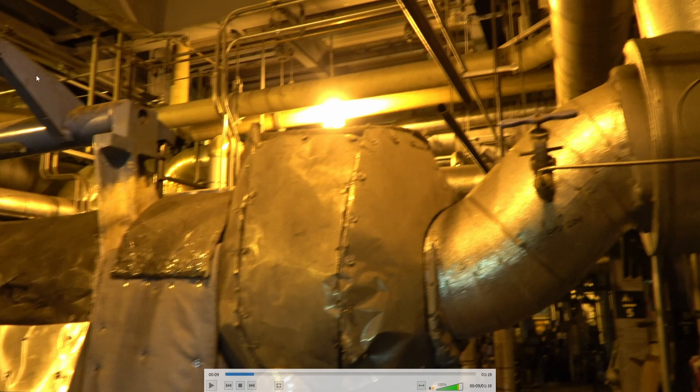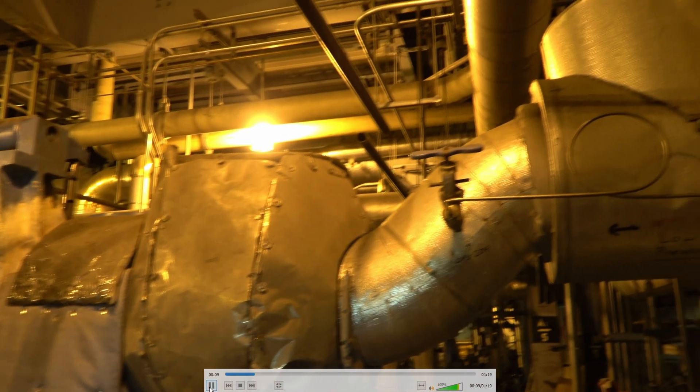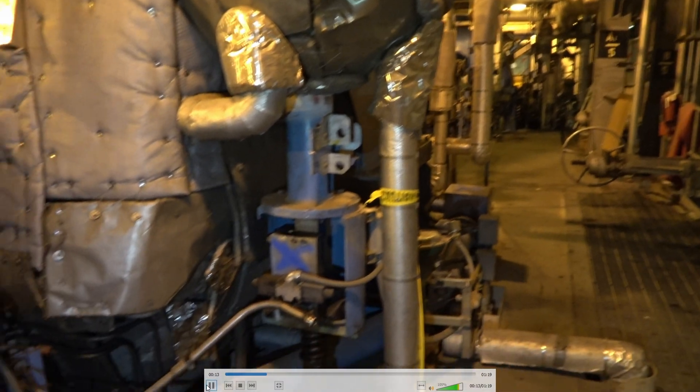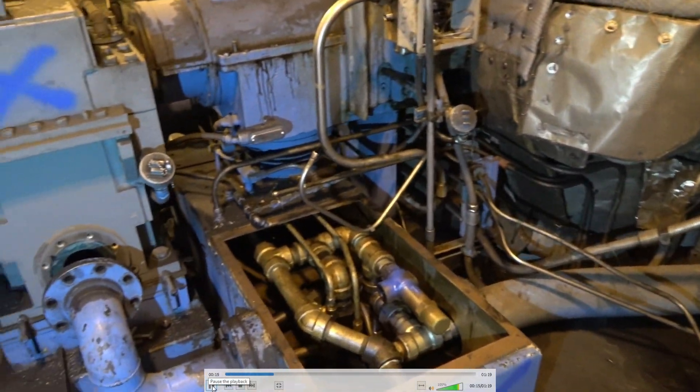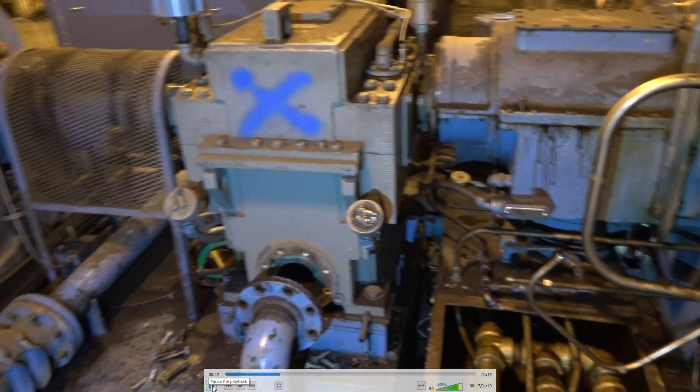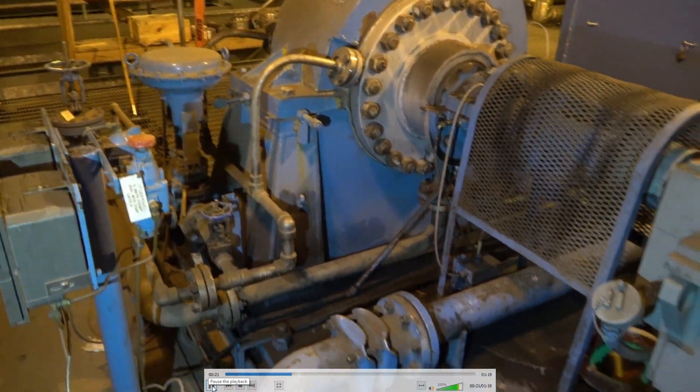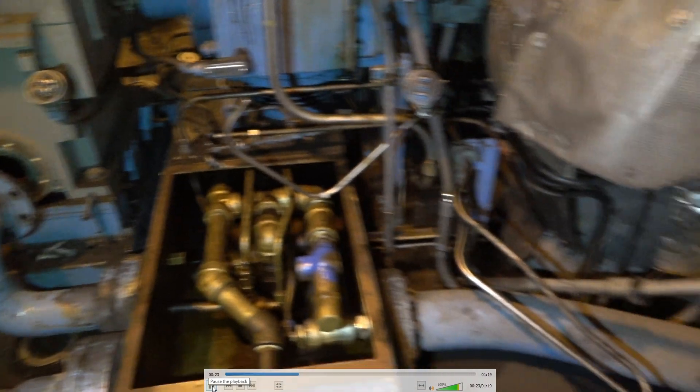This is the rack for the low pressure steam. The rods go down here and you have your little poppet valves that sit on a beam — one will pick, then the other one. It's set to stage how much steam goes through; this runs about 150 PSI. The other side can run almost full boiler pressure, 2500 PSI, but usually for startup you're only at about 600 PSI, then you'll switch over.